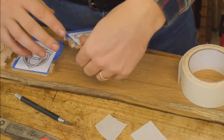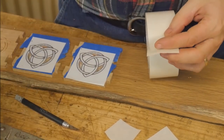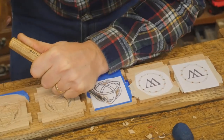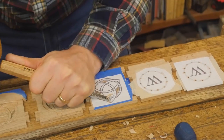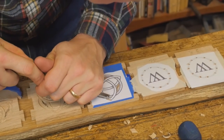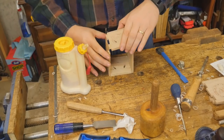Once they have been cut out, I put some double-sided tape and secure them down to a board. This allows me to carve on the bench top and secure this board to the bench top rather than having to secure these little pieces. This is a V tool that I recently picked up and I absolutely love it — it's a lot better than my other one. This is a simple way of doing carving and following these lines; you can get a generally good image very quickly and you get this hand-carved look with a simple tool. I'll leave a link to that tool in the description below.